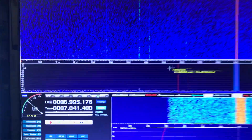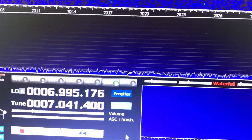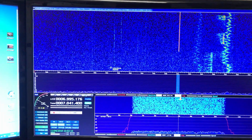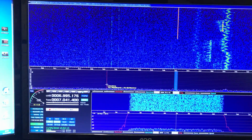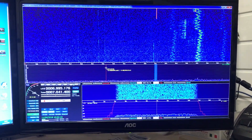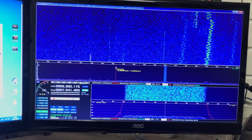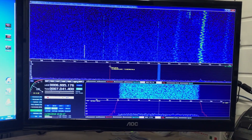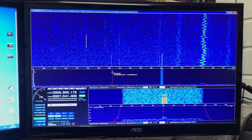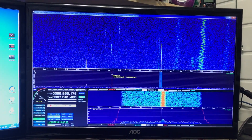You can also control the radio through HD SDR — change the modes and so on. You get your full-screen spectrum display and waterfall, and you can switch these around. So that's the MFJ 1708 SDR antenna switch, HD SDR downloaded from the SDRplay website with the EXT IO files already built in, and OmniRig to control the radio from HD SDR.